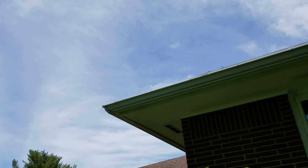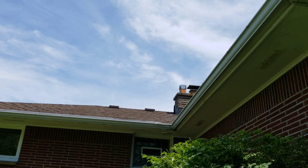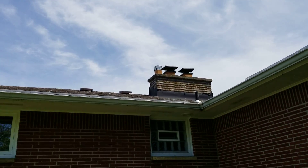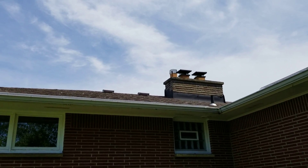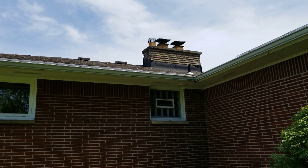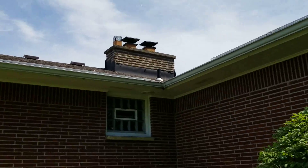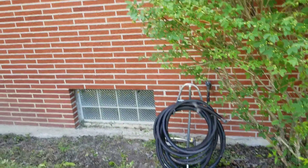You can see where some of the screen is pulled off and throughout the house where water has been getting behind the gutter. It looks like there's old original aluminum flashing at the chimney but it's been painted black, so I'm gonna go in there and see if we've got any signs of moisture and make sure that's okay. I've gotta go down in the basement before I leave because the garden hose is leaking — I couldn't get it to turn off out here.